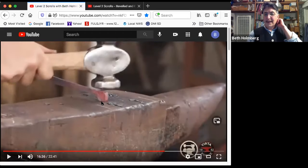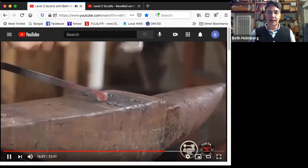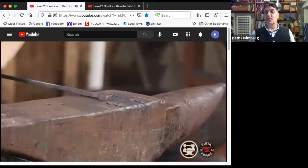Well, I was hammering on the other side, and whichever side you hammer on, you get more effect than the side that the anvil's on. They both kind of squish, but more on the hammer side. So I didn't feel like that was getting smushed quite enough. Flip it over, and I'm getting the hammer right on it, and I can get that flattened out more nicely. That's starting to form a little bit sharper corner. That's kind of nice.